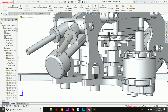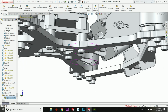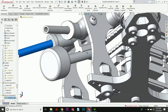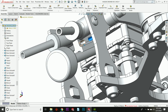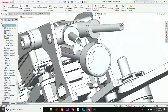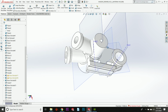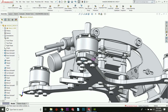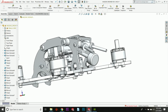So not only can you put your receiver tubes in here and run your receiver antenna through that, but you've got an integrated way to mount the antenna. It's basically a cradle that the antenna sits against, and then you have two little slots for your zip ties. You wrap the zip ties around, and that thing is mounted in there. The antenna mount is a TPU component, so it allows some deviation and movement in crashes, and it's also positioning the FPV antenna in an ideal location.